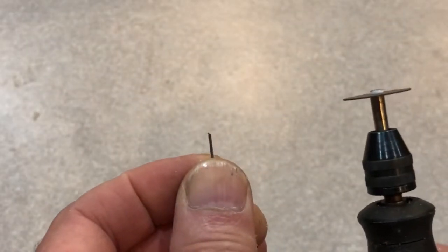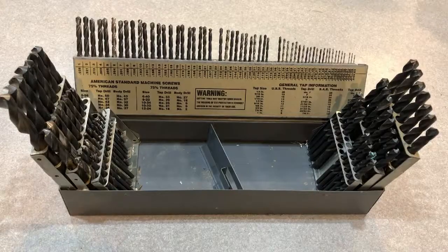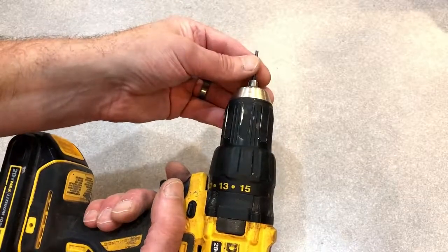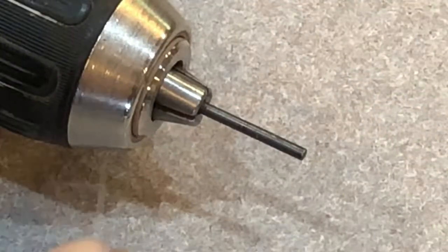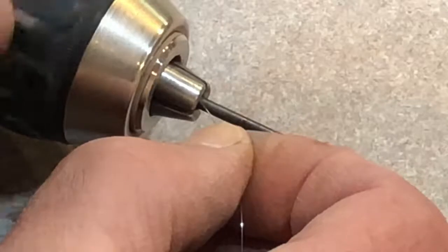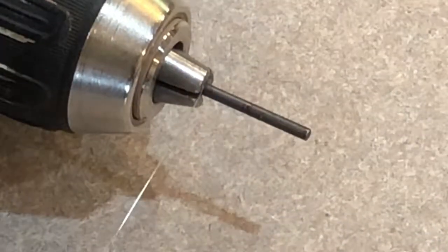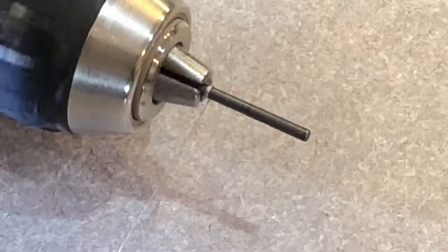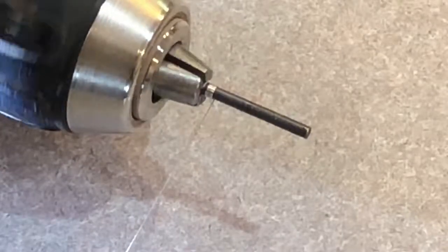Let's wind some springs. To wind a spring, you'll need a mandrel to wind it on. Drill bits work great and come in a whole variety of sizes — behold the drill index. Put the mandrel in the drill chuck. Get your spring wire and insert it so it can be clamped between one of the drill chuck jaws and the mandrel. Just a little bit of tension on the drill chuck is all it takes. With my left hand holding the drill and my right hand pulling tension on the wire, I run the drill as slowly as I can while pulling tension on the wire. I'm watching the wire very carefully as it winds along the mandrel, making sure that it winds evenly and winds tightly up against the previous winds.